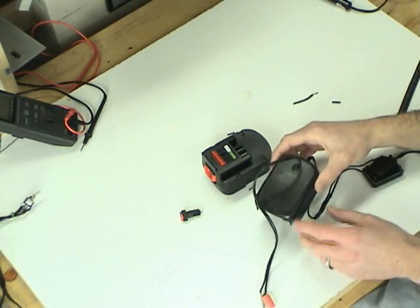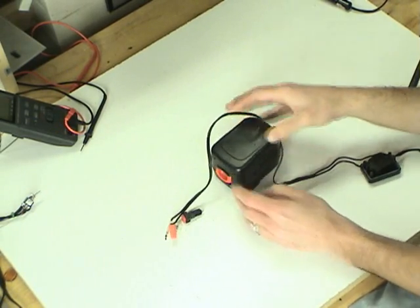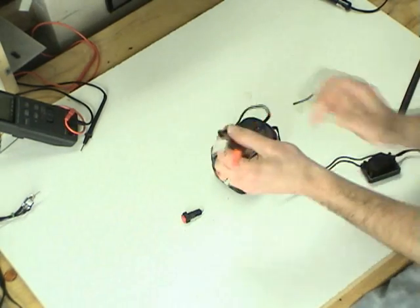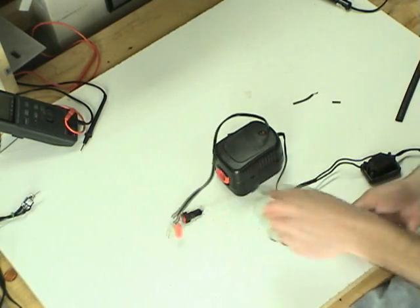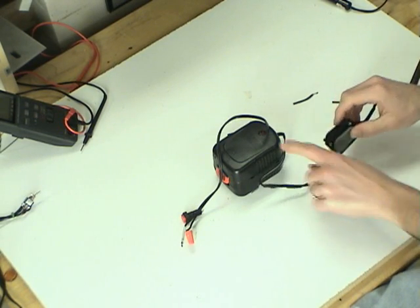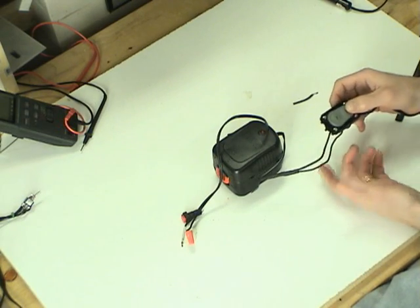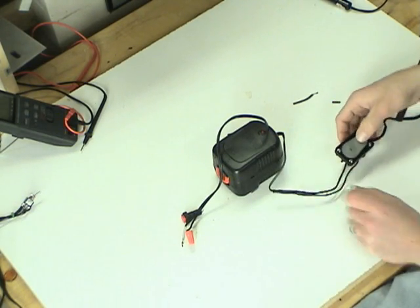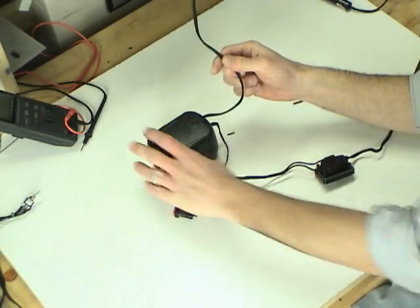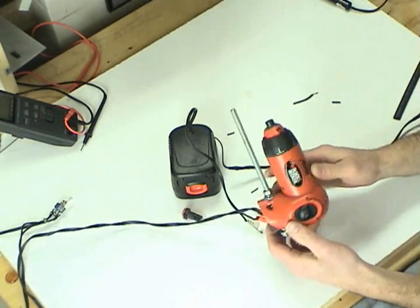So there we have a nice strong splice between where this plugs into the wall and the switch that will activate the charger for the battery. The next thing I did to the charger itself was wire in a lead that, when this is on the battery, is tapped into the positive and negative of the battery — and this gives me the power for the motorized router lift. You can see that our switch is working: when we turn it off, the charging light goes off on the unit, and when we turn it on, it's charging. So now we have a power source that we'll be able to keep charged up that matches the motor itself.